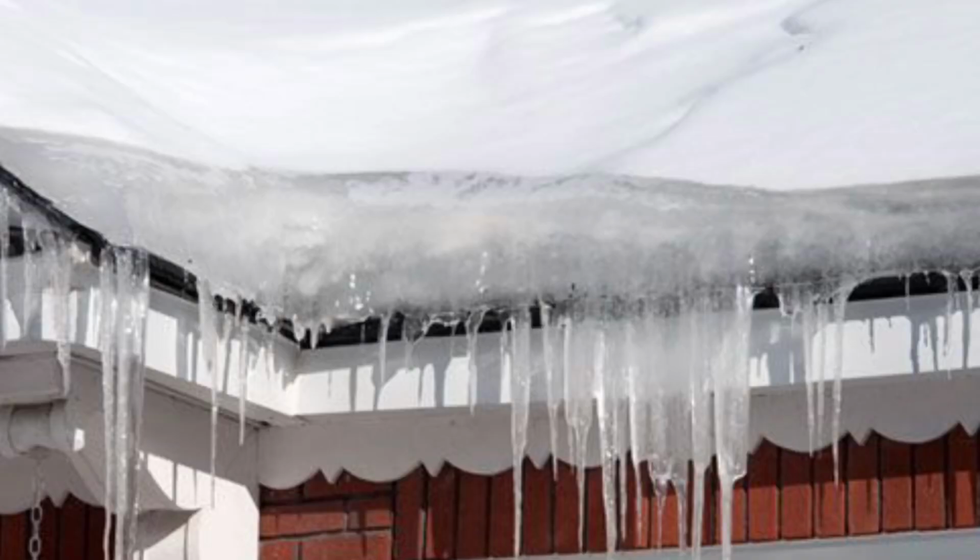Shingles do not work great on low pitch roofs, and that's because wind-driven rain can actually blow up under the shingles and get down through the nail holes. You can use shingles on a low pitch, but again, you would want to use ice and water shield underneath the shingles, and this would seal up the penetrations of the nails. I also recommend that you use ice and water shield around the eaves, the overhangs, on shingles, because water that comes down your roof melting can refreeze on your overhangs and create a dam that would cause water to pond, and then again the water would back up under the shingles and get under your roof.